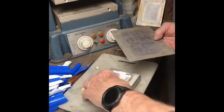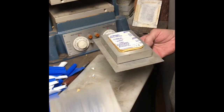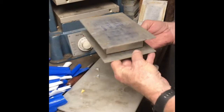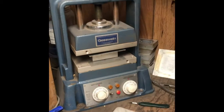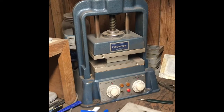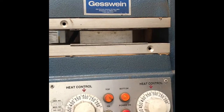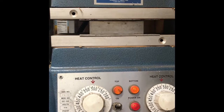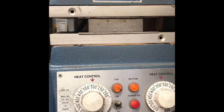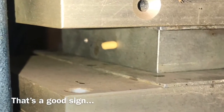These are the sheets that this goes into for the pressure of the mold maker. This will slide into here like that. And now I'm going to crank this down. There are small holes in the side of the mold frame that rubber will actually extrude out of, so I'm going to keep cranking this down until I see that.